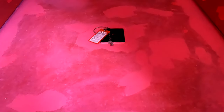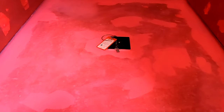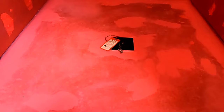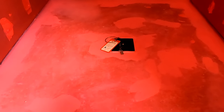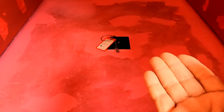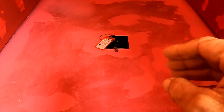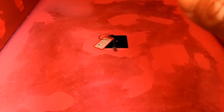I want to come on camera and talk about a seal system. There are two types of systems. The first is a water-in water-out method where your shower pan mortar would absorb water through the grout lines, the pan gets saturated, and with a pre-slope of a quarter inch per foot the water hits the pan liner, trickles down to the weep holes, and then exits. So as you take a shower all that water goes in and then goes back out again.